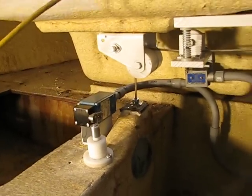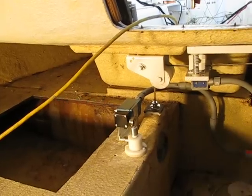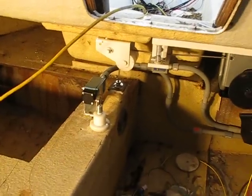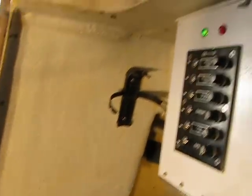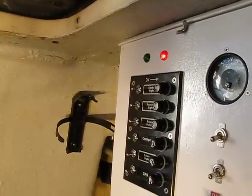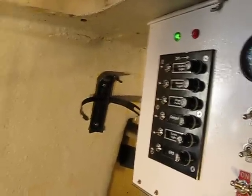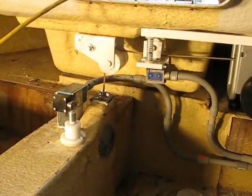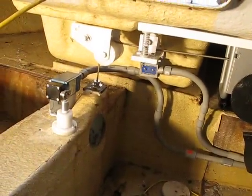It's a pretty nice system. I can sit in the cockpit with this remote right here — just the down switch and the up switch — and I don't have to get up, stop everything, and hand crank the keel up and down. You can see when I enact it to go down the light comes on, and when I bring it back up the green light tells me it's up. If there's any questions, give me some comments and I'll be happy to answer. I think this will make a nice sailboat and take a lot of the work out of it. So there you go.